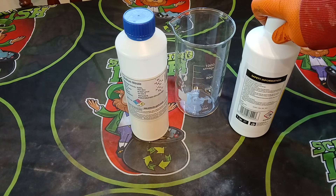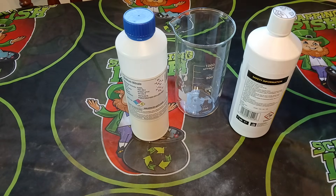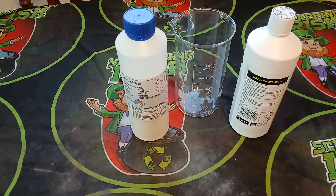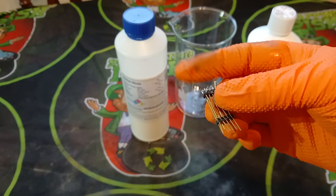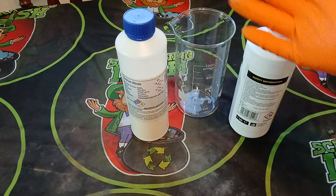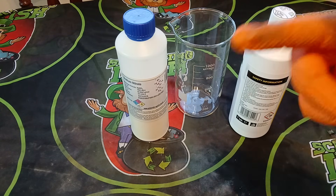I'll be wearing my gloves as usual because when it gets hot it's very dangerous. I'll be starting off with about a liter of distilled water, putting in about 50 milliliters of sulfuric acid, and adding nitrate salts as needed to get the reaction going. The material I'll be using is gold pins - gold plated pins like those from a previous video but this time using poor man's nitric. Safety first - remember masks and gloves.